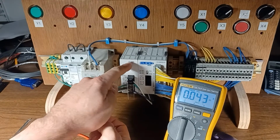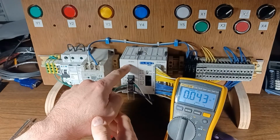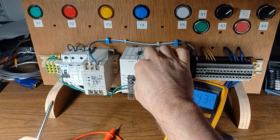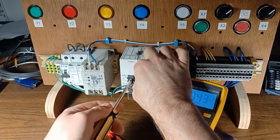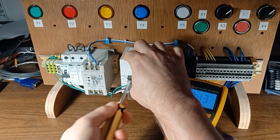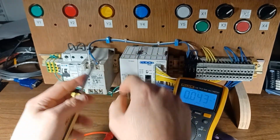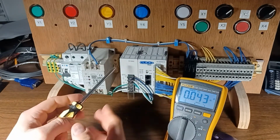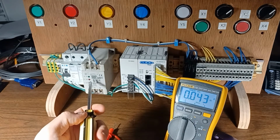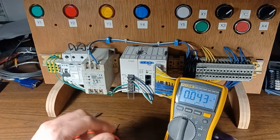This is obviously the power supply that is from the CLICK PLC line. It matches it nicely. So I was figuring on using that. It's rated for 500 milliamp, half an amp, so it'll do everything we need with room left over. If it was going to be tight for some reason, I didn't think it would, but I didn't have a good sense for how much current the PLC itself draws. This old Omron supply is rated for 600 milliamps, so that was an option. But yeah, that's it for today.